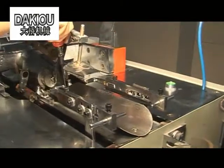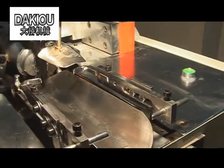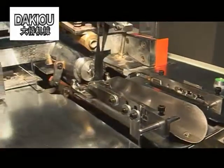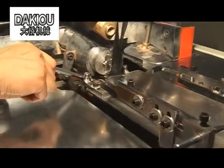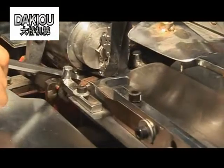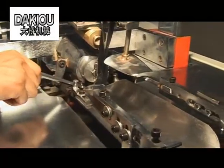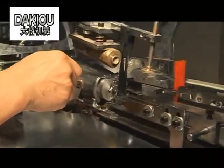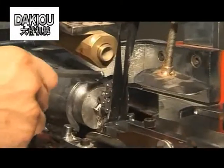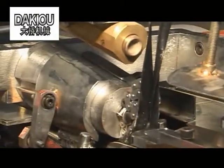8. Remove the central panel. 9. Remove the left and the right welded hinge axes, and install the two unwelded hinge axes. The right hinge should be faster than the left one by 1 to 1.5 mm. Weld the hinge and the hinge axes.